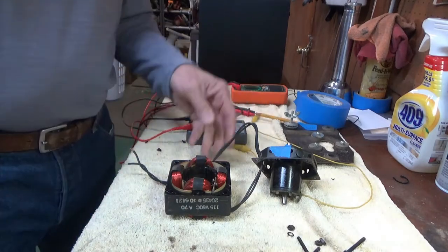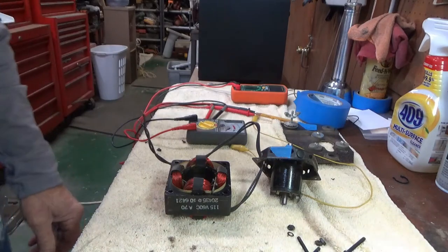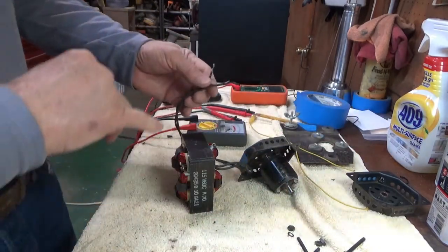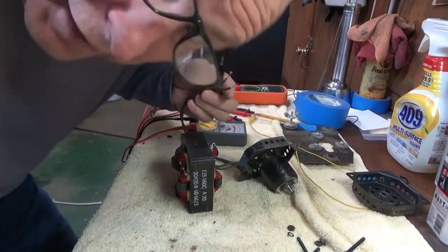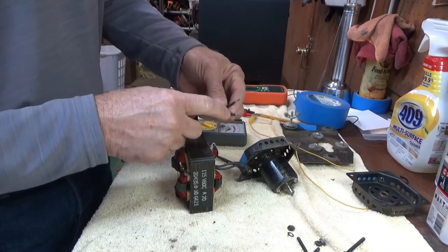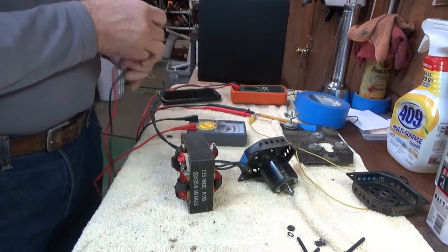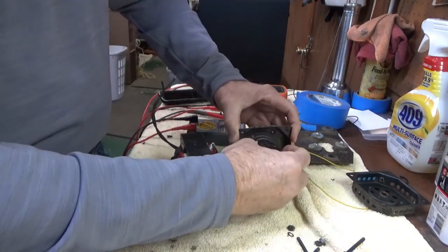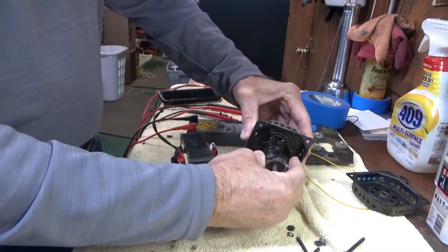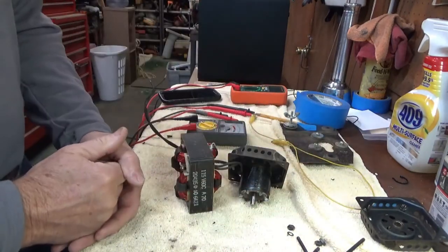I'm not going to call this a wasted effort — nothing wrong with the motor. What I found is that the insulation, until I put my glasses on, I couldn't really see. It looked like copper-colored wire, but it was actually additional insulation on top of the black insulation. Once I peeled that off, now look at that — you've got good continuity. But I had to take the motor apart anyway to lubricate everything. I lubricated the bearings — they have nice swiveling cases. I also did the same thing on the bottom bearing, got lots of oil in that. Cleaned it all up. I'll put it back together and I bet it'll work perfectly.